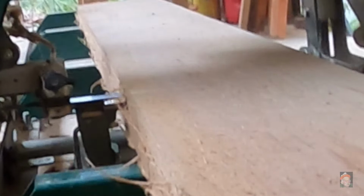Now I have to make some 3/8 to finish off that short one. Cut another one of these first, maybe two more. I did something I hate to do. First time I raised this out of the way to get past a very big log, I cut into a log stop. But I have to work close to the log stops. Can't have the blade guard down. I hope I remember to put it back when I'm through with this operation.